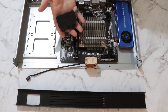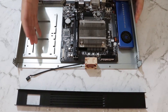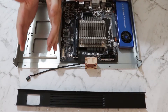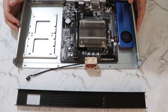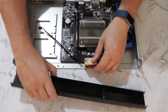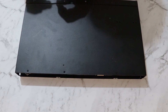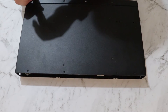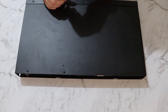Power supply is going to be an issue. I did consider using the Compact DC-160, but I'll probably go for an HDPlex 400W AC-to-DC and use the space in here. I don't really need to use 2.5-inch drives since I have a NAS. I could just mount a flex ATX power supply in there, but where's the fun in that? So we put the front panel back on, and in the coming weeks I'll buy the other three 40mm fans for the front as well as material to make a replacement front panel and other mounts.